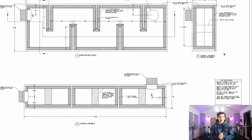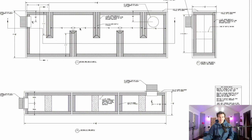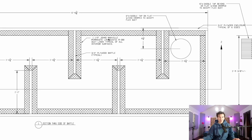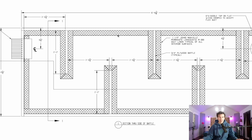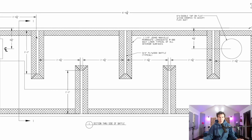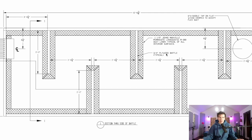So now we're going to look at the actual plans Rod gave me. Looking at this top box, we have dimensions of six feet, six and seven-eighths inches long, two feet, two and a half inches wide, and a depth of one foot, one and a half inches. The air comes in through a six-inch saddle tap on flat with end crimp to accept flex duct. We're using three-quarter inch plywood all the way around as the baffle.